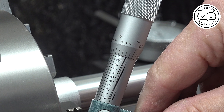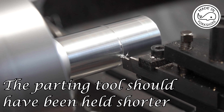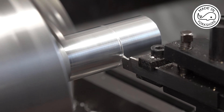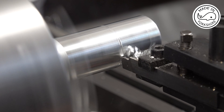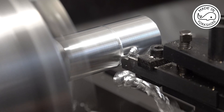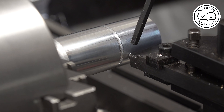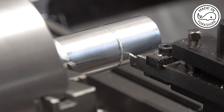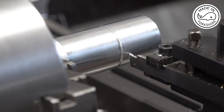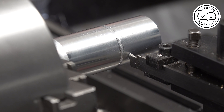1.002 - happy with that. So I'm just going to machine the top of this piston with the parting tool. This parting tool is 62 thou wide, so I moved the carriage that way by 62 thou, then I moved it again by an eighth of an inch. Now what I need to do is start cutting the groove, so it needs to be 80 thou deep.